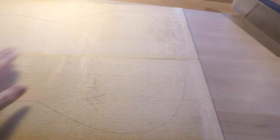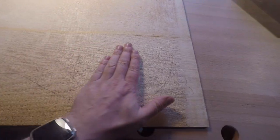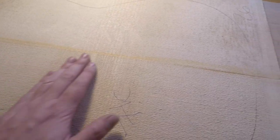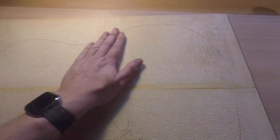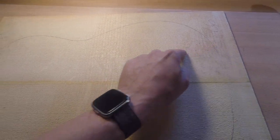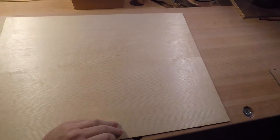So this side, when I go from left to right, will go smoothly. On the other side, you can see you go against the grain of the wood. So it's important we plane in this direction, because the top is book matched. You stroke the other side of the wood, you notice we have to plane in this direction. So the top plate has the right thickness.